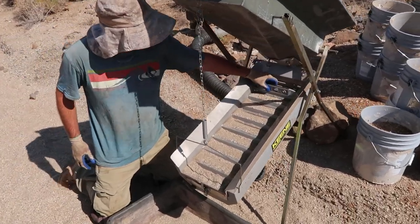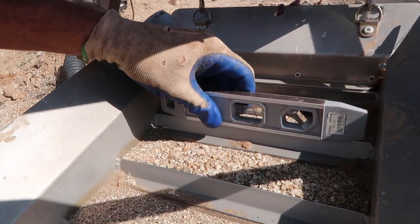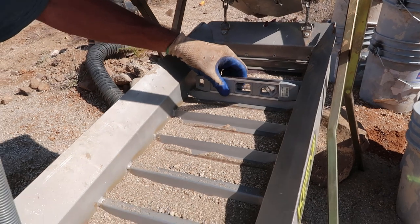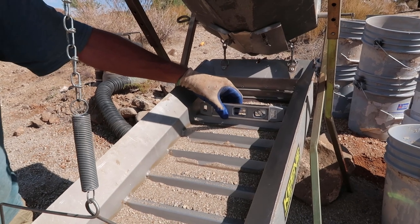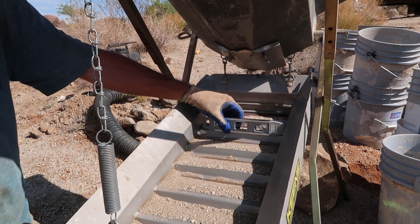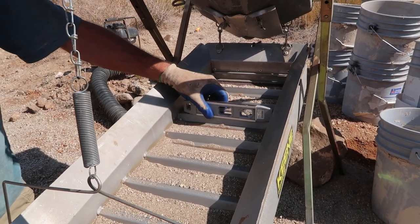I want to make sure I'm in the bubble — see that? Dead level. Check all your bubble levels because sometimes they're bent, so double-check. Some are installed a little off or have been damaged from moving and getting hit, so your third bubble might be your accurate one.